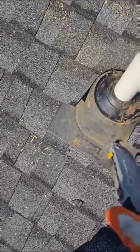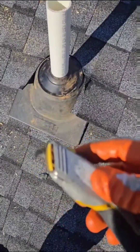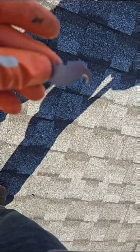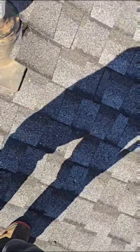I've got it in there. Now I've got to trim the shingles away from the boot. You want to use a hook blade — hook blade looks like this, buy them at the hardware store. These are for cutting shingles and stuff. I've got the hook blade, wouldn't recommend doing that without.